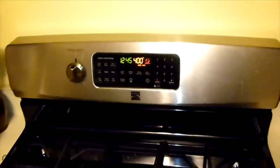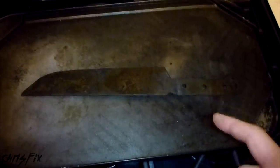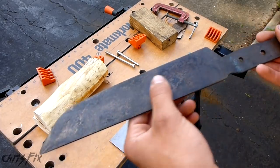So it's two hours later. I have this tray ready and I'm going to put the knife on the tray and let it cool to room temperature. Once it's at room temperature, back into the oven at 400 again for another two hours, and then we are done. Now that the blade is cool to the touch, we're going to put it back in the oven for two more hours at 400 degrees, and then the heat treating is complete. Finally all done. After four hours of total soak at 400 degrees, we'll let it sit until it gets to room temperature, then we can start working on it.